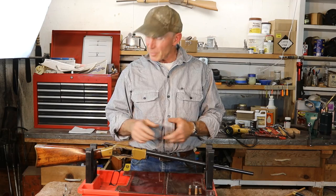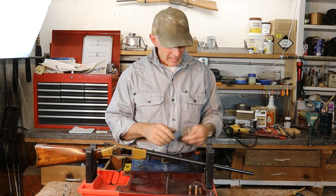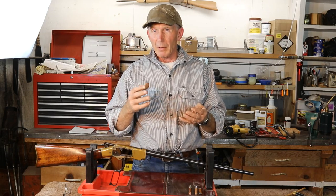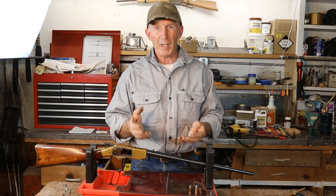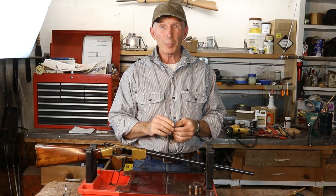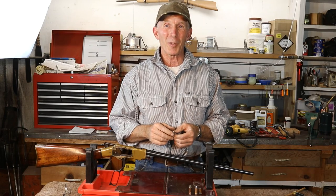The customer has some decisions to make about where to go from here. Because this one has a poor chamber, the rifling is pretty marginal, and the outside of this barrel has been heavily polished, it really limits our options — most likely meaning a replacement barrel. Since a used barrel for a Model 66 in serviceable condition is pretty hard to come by, it most likely means having a barrel made. I hope you learned something today. If you find yourself in need of casting your chamber, don't be intimidated — it doesn't take a lot of fancy equipment or tools. It's a fairly simple process and you can learn a lot from it. Thanks for joining us — until next time, happy trails from the Cinnabar.